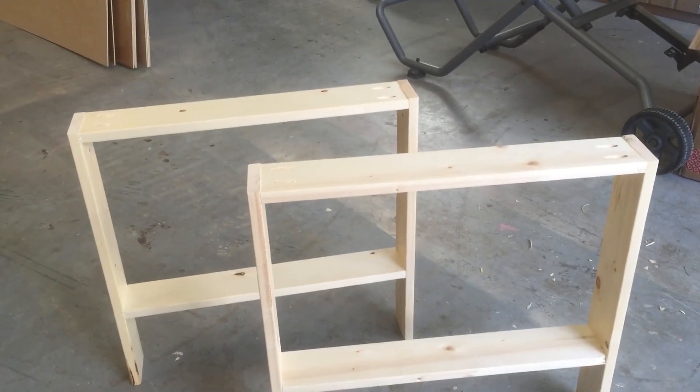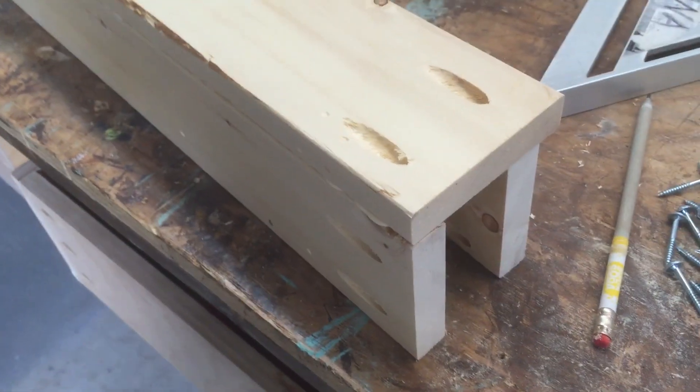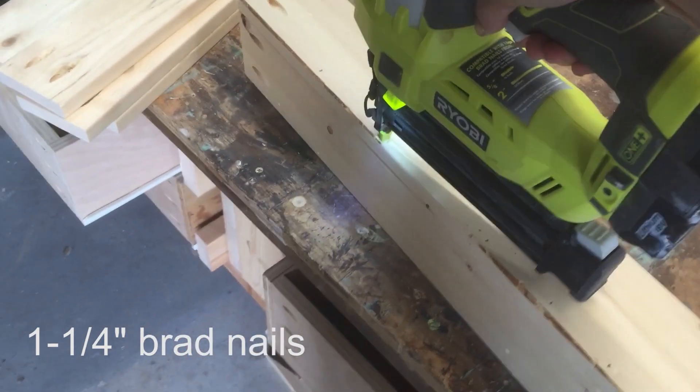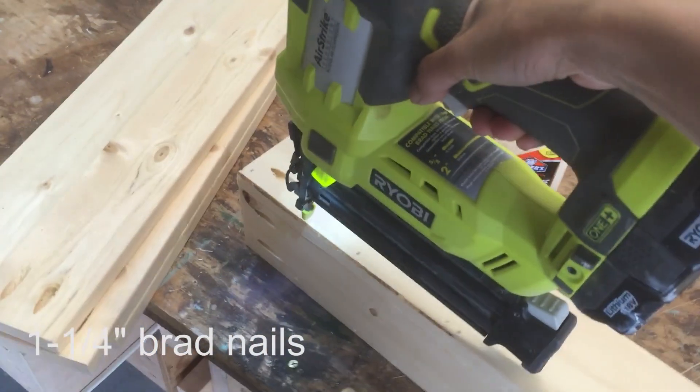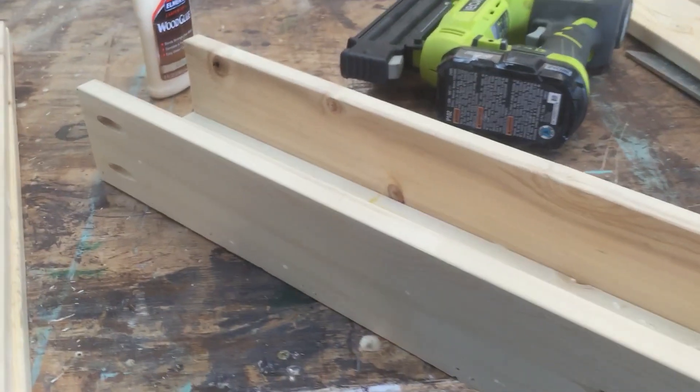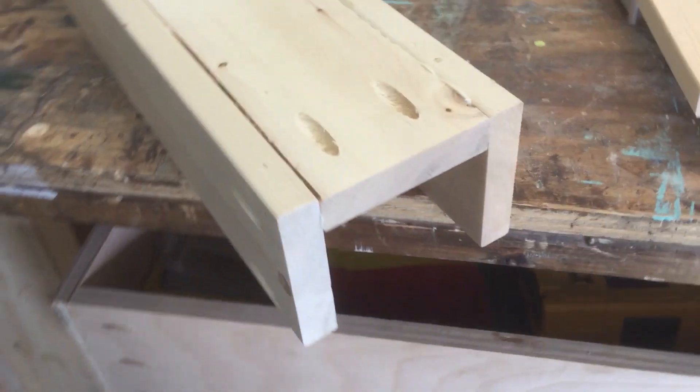You can see on the bottom board, because that'll be exposed, I hid my pocket hole in the underside. Now for the trays, I'm just resting — that's actually a sideboard resting on the bottom board — and I've got another one of the 1x4s as a support just to hold it up for me while I nail. So there is one tray done. You'll notice that I've drilled pocket holes all the way around so I can attach it to the side aprons.